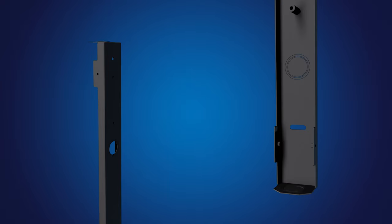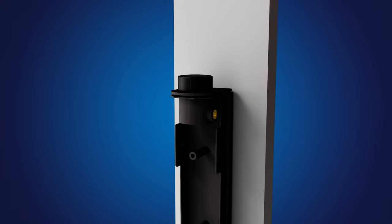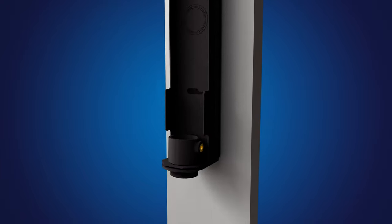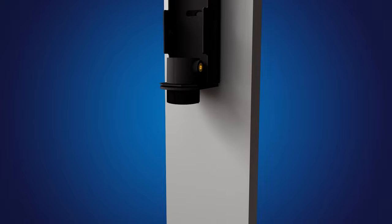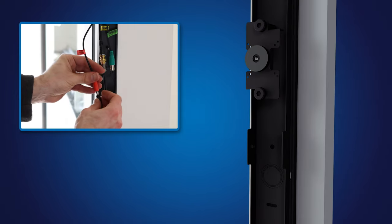To begin, remove the top and the bottom knockouts from the height strip camera's rear housing and insert the housing into the angle bracket, seating the tops and the bottoms together. Next, temporarily secure the housing and angle bracket with the included 3/4 EMT threaded adapters and caps. Then, select a cable access point from one of the 5 3/4-inch knockouts and connect your power and video connections.